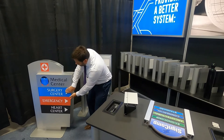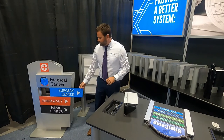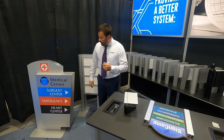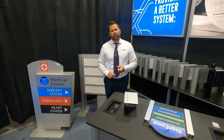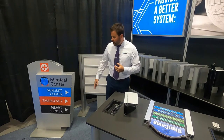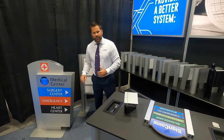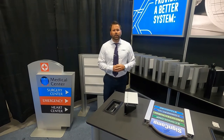There's a black anodized system; we supply panels at four inch, six inch, and eight inch. The anodization helps them slide better when servicing. If you want something outside of those panel sizes, we have adapters to allow a custom aluminum or acrylic panel that routes out and attaches to the back, still working within the system. Rounding this out: curve cut top, variance in depth, any kind of decoration, and custom miter cuts — we can do that for you. This was our architectural product line.